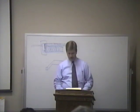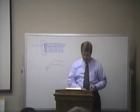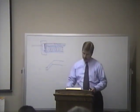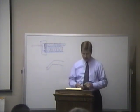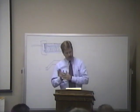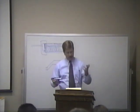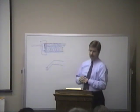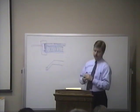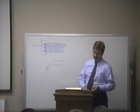Another area to deal with on infiltration, I might say this, this one back on page 80, reduction of infiltration during construction of new materials and labor can easily reduce the infiltration rate 30 to 50% or cut your energy, heating and cooling, by 5%. And those are ballpark conservative numbers on commercial buildings. On residential, it's substantially higher.